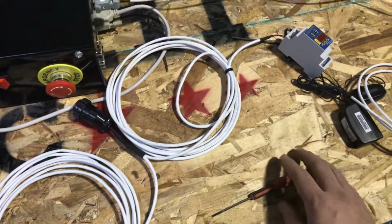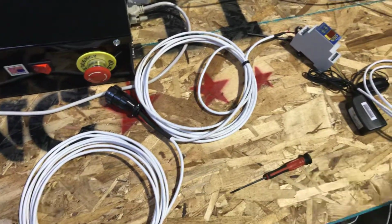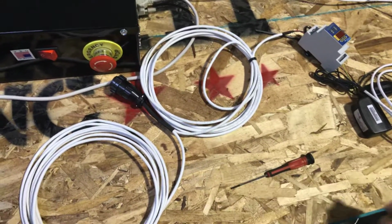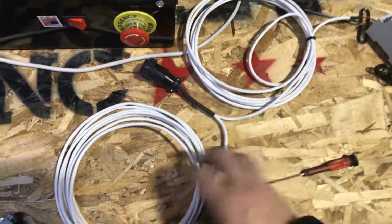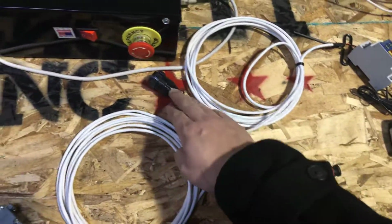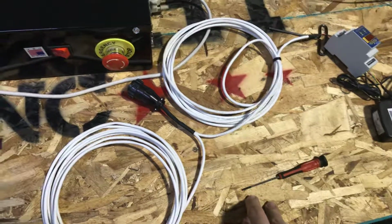And if you follow the instructions based on the pinout for your machine, which in this case is likely going to be an Everlast, but if you have a different style, most of these systems will give you a schematic of the breakout of the pin itself, and we'll be able to adjust for that. So 2 wires off of this, 2 wires off of this, both leading into this plug. Go ahead and snip, strip, and prepare to attach those to your CPC plug.